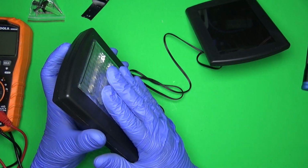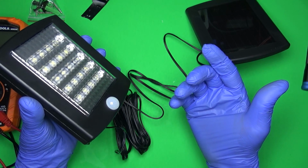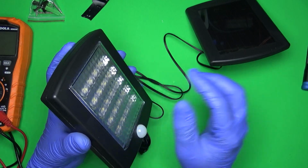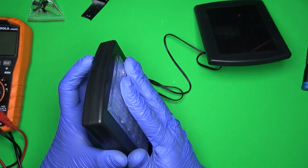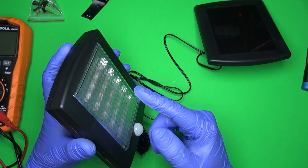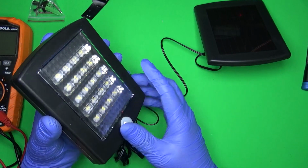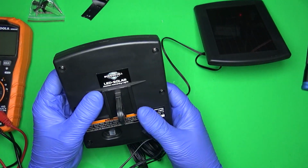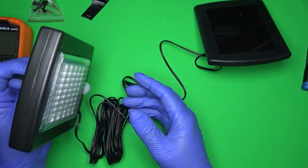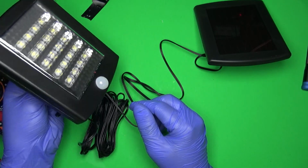Whereas when this thing is on dim, it's going dead every night within, I forget, what did we say, 6 hours? And then over time, when the panel can't charge the battery all the way, the battery will only last for a couple hours. So you're constantly running the battery dead. With this mod, yeah, you're saving your battery. It will actually act like a real floodlight where it'll turn on when it sees motion, and maybe you'll get a year or two out of it.